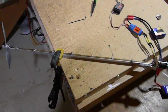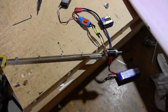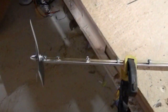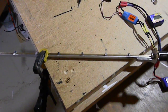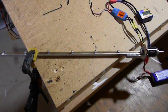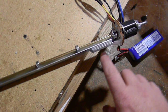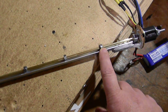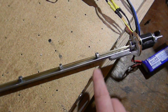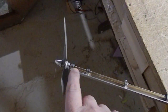Here's what I got: an 1800kV NTM prop drive and a 7.5 prop. I've been trying to come up with a way to power both an F4 and a BD5, and there are a couple other designs that could use this. I was wondering if I built a drive shaft extension, so I rigged up a half inch by half inch aluminum channel, epoxied on some aluminum spacers to clear the collar. These are 3/16 bearings with about a half inch outside diameter.